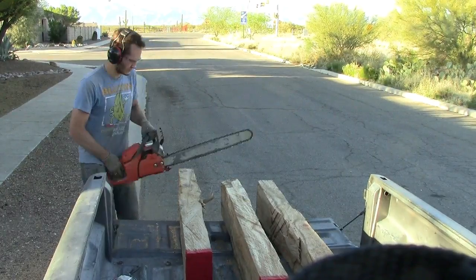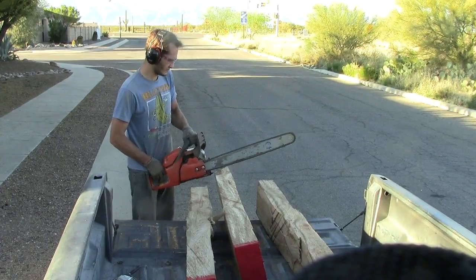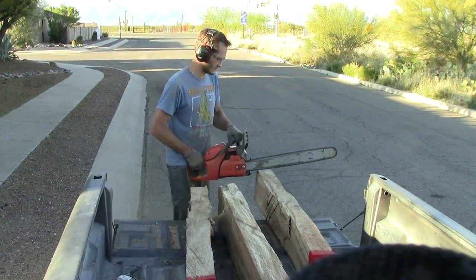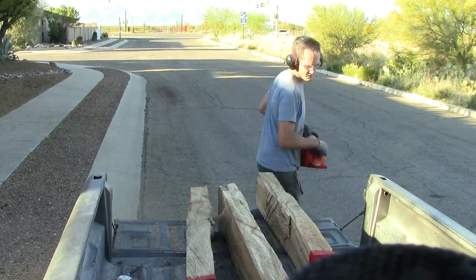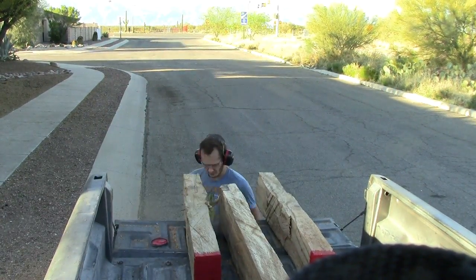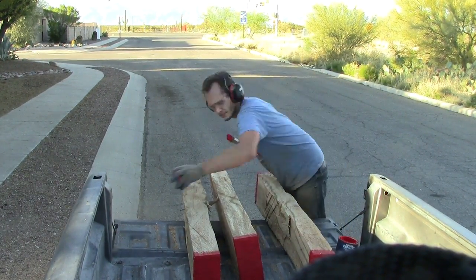Here I'm just cutting off the ends — I cut as far as I see the crack go, usually about two or three inches. The billet will want to move a little bit so I just let the saw take itself down without forcing it. After that I take my paint and put a nice liberal coat all over the end — a nice red coat.